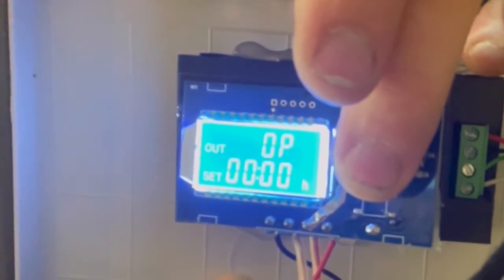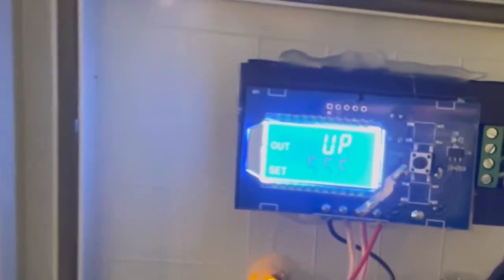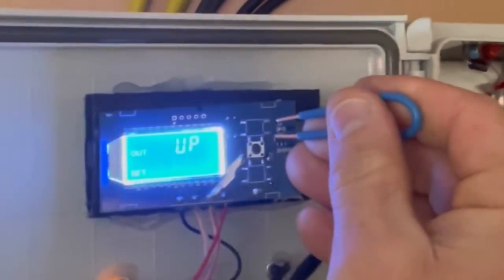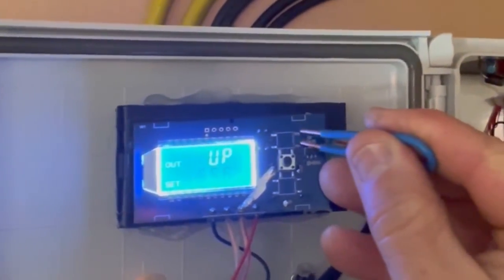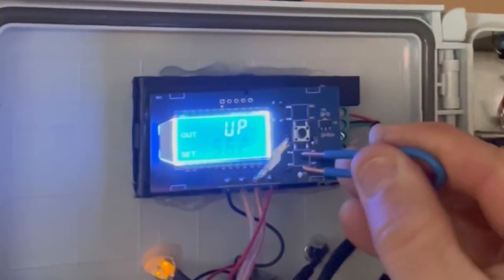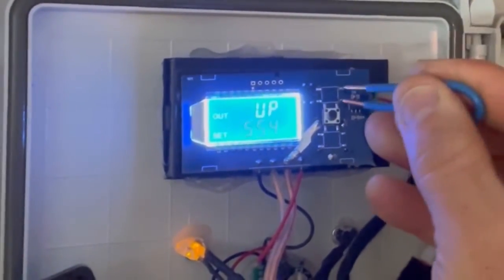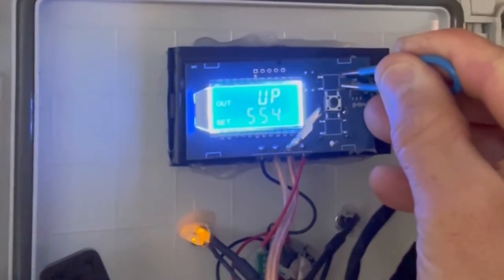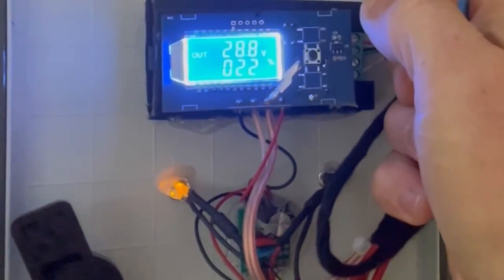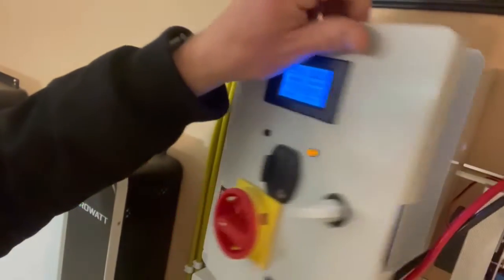I made myself one wire — 55.6 volts is the braking voltage right now. We can raise it up by using this copper wire here, as you can see, and we can lower it down with this one here. 55.6 is what I prefer. Just press the menu button again. If they had just left this adjustable it would be perfect, but now you have to make this hassle to get it working the right way.